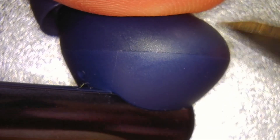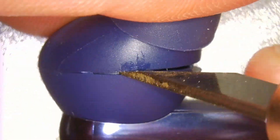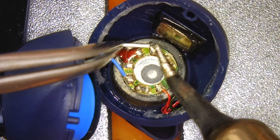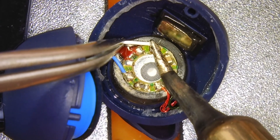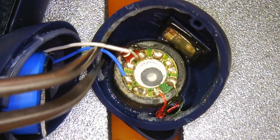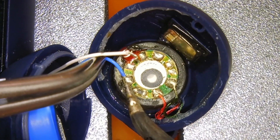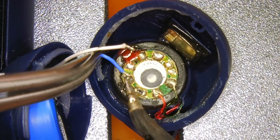The first thing that I did was tear the W1 earbuds apart. I did so by using a chisel and slowly worked my way around the earbud until the two pieces came apart. We obviously have to remove the driver part of the earbud, so I did so by desoldering those tiny little wires off, and I also took note of the polarity. In this case, blue is positive and white is negative.